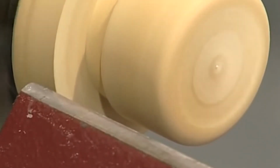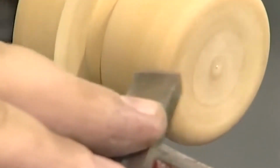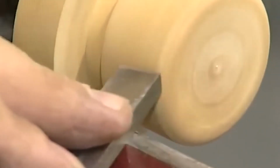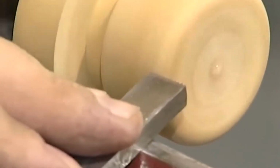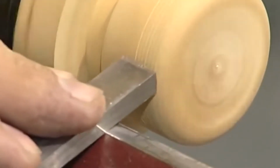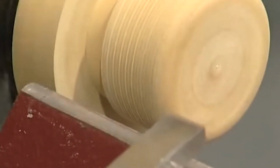By rubbing the heel of the cutter against the revolving workpiece, the helix angle we mentioned earlier pulls the tool across the wood, scoring it with the shape of the thread. Some styles of thread chaser have little or no helix angle. These engineering tools, used like this, would produce no thread, only concentric rings, as they were designed to clean up pre-machined threads.